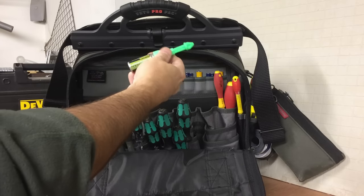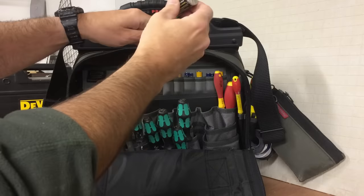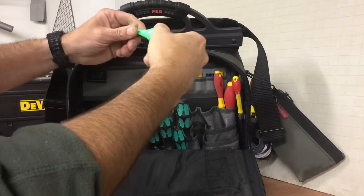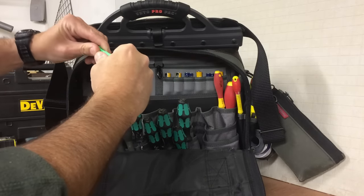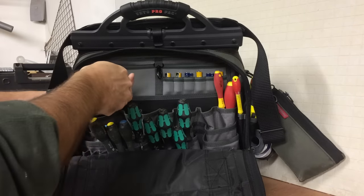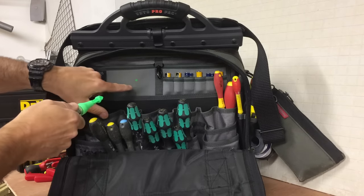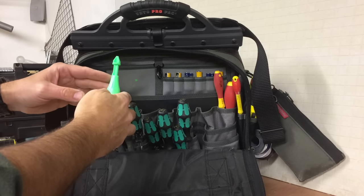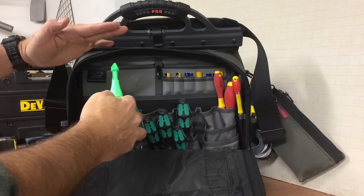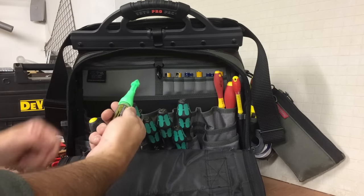Another deep hole marker — this is a normal marker from Marksman, the Gripit Marksman. Stick it in the hole, press it, and you get a puff of chalk. I'll actually show you it in the bag here — push it, see the little mark there. This actually works from a distance of about 50 or 60 millimetres. Anything that deep — 4x2, anything like that — it works perfectly.